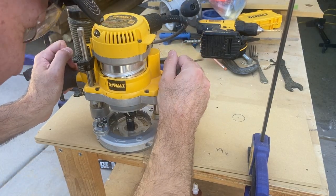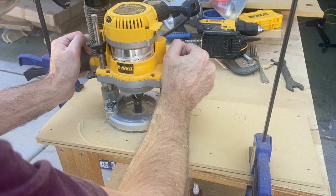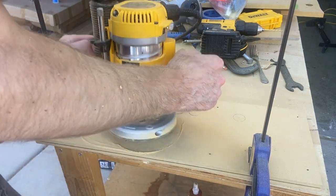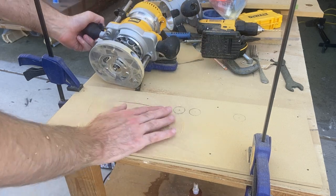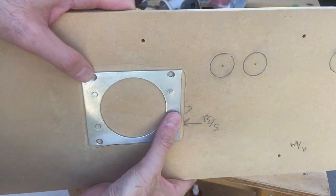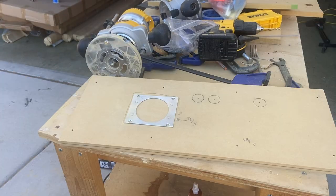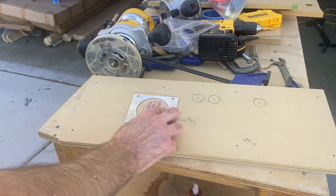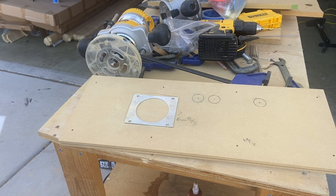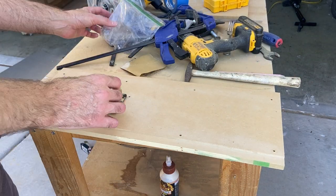After that, we're going to route a small groove for the bracket to sit in. We need the bracket to sit flush on top of the control panel, so we have to cut out a groove on the top. You can see right there that there is a square groove, and once we set the bracket in it, it's going to sit flush in there. Inside is going to be where the washer floats. I'm going to cut a deeper groove because I don't want that washer sticking on any piece of the control panel plexiglass or the laminate going on top. You can see there's a slightly deeper hole for the washer to sit inside.